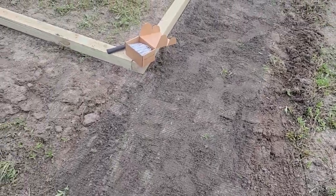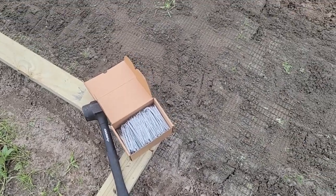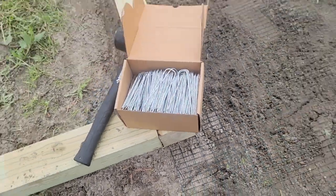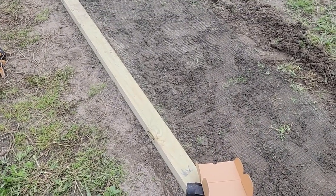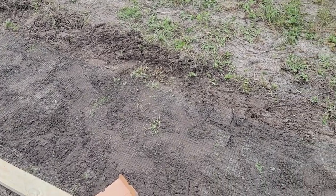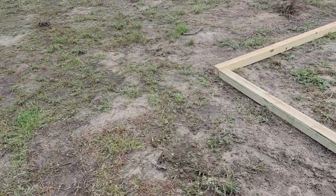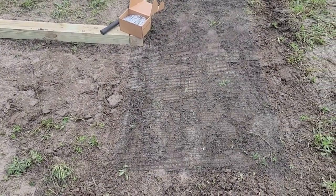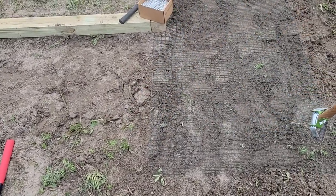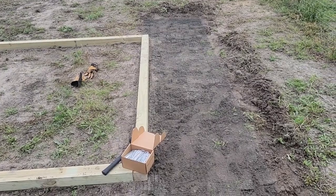Now it's all sitting on the perimeter. Here are my yard staples, and I've got my trusty mallet. As you can see, the mesh is going underneath that 4x4, so the weight of the entire structure is going to help hold it down. Andrea wants to put staples about every 8 inches on the perimeter. We are going to overlap when we go down and do the sides — by overlapping, we'll be able to protect the corners properly, so it's going to overlap and cover the corners. Let me get these staples in.